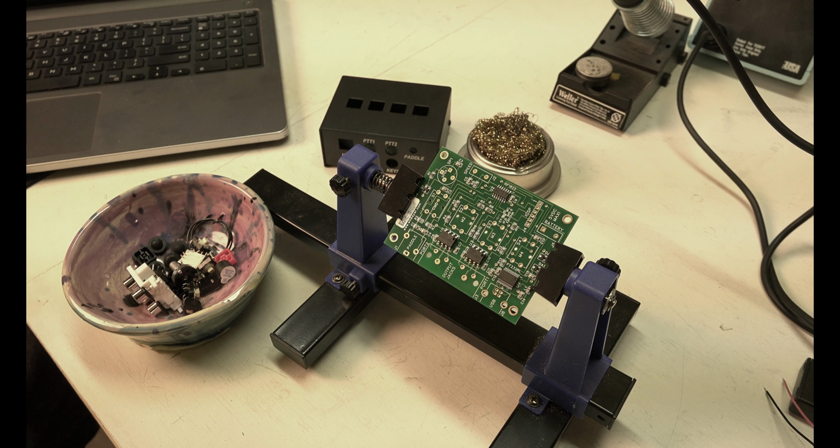The bigger the metal you're doing, the longer it takes to heat up. You'll figure that out real fast when you do a big piece sometime. You'll need a bigger soldering iron, but I'll tell you, using this holding device is really nice. Now, you've got to check and make sure you don't have what's called a cold solder joint. These all look good. I'm flush against there. I don't need this tape anymore. And now we can move on.